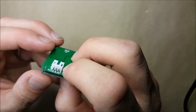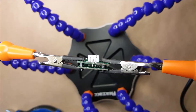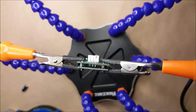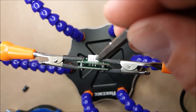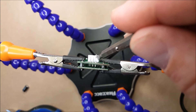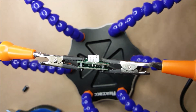In a moment I'm going to do these modifications, starting with the RC filter. I've set the microwave sensor up on the bench. I did something off camera — on the power pin, which is the one on the far right hand side, I used a pair of snips, cut the pin coming from the socket, pulled the pin out and turned it around 180 degrees so that the pin is now pointing up.